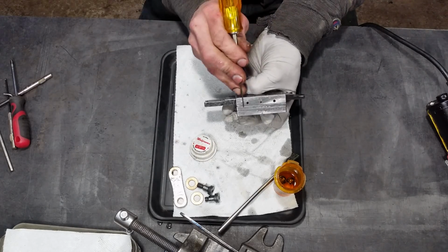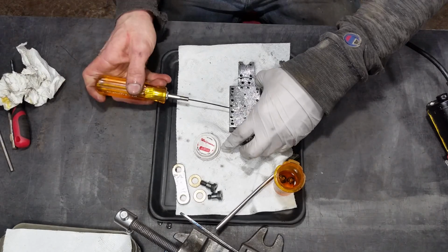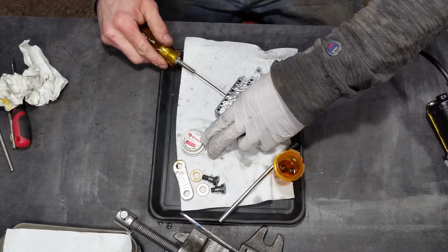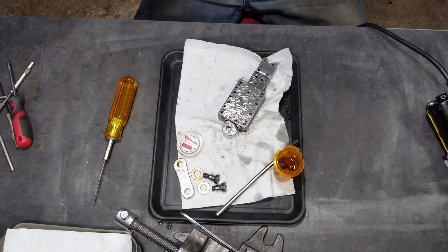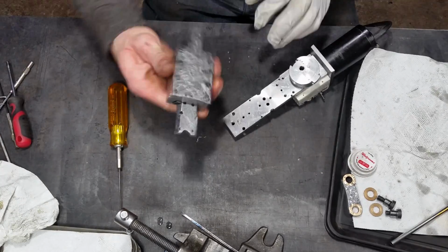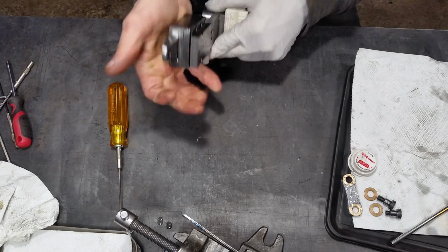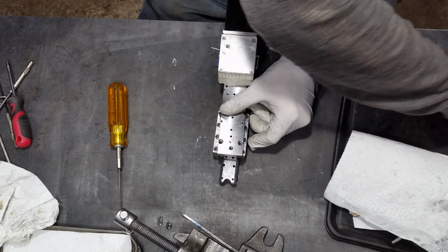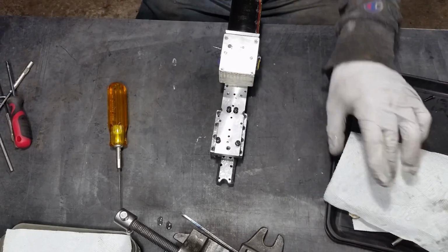Right now I'm adjusting the gib screws here. Those are 6-32 set screws through the end, and then a second 6-32 set screw that is cross-drilled for that. That one has a nylon tip, and it basically just retains the first one. That's a pretty good system, especially since I didn't want to have screws and stuff sticking out the side there. I'll do the final adjustment once that's all in place and powered, just basically based on how the motor bogs down. I'll tighten up the gib and the motor will start to bog down. I'll back it off just a touch, and there you go.